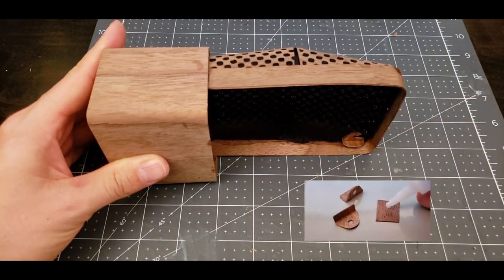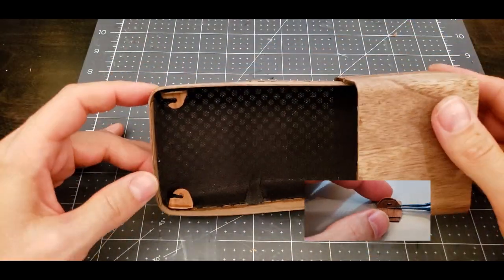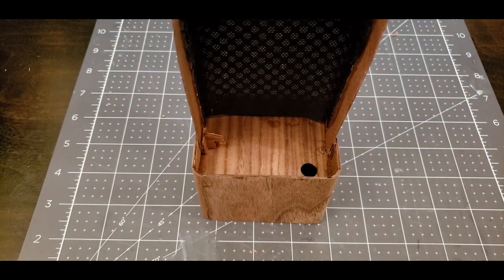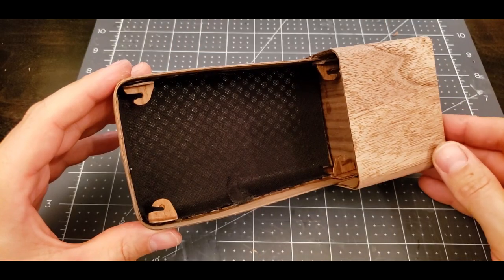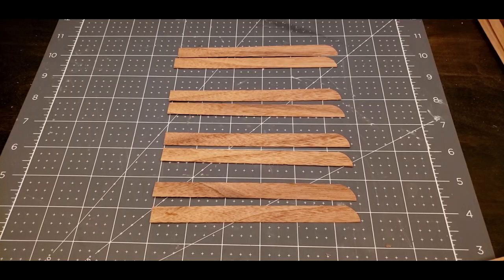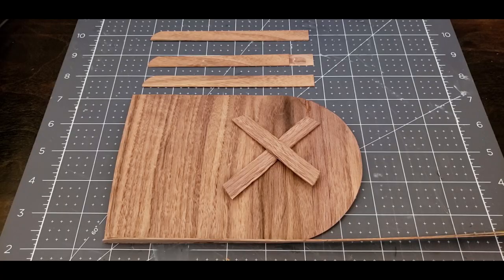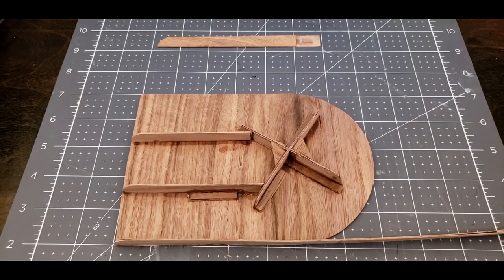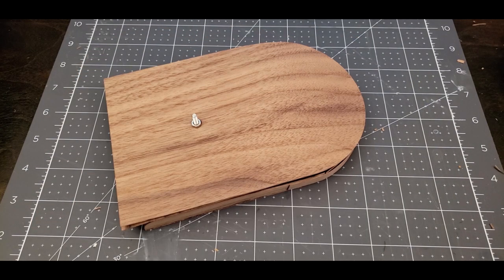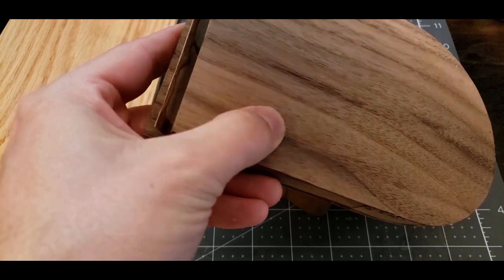Wood mounts are glued into the body of the microphone. The base of the microphone is made primarily of one-ply veneer. Most sections are glued together to make a stronger ply part. I used X-bracing to make the stand rigid. Since the big curve on the back of the stand is very wide, it doesn't require steam bending. The top sections, which will bend down over the front lip, will require steam bending as part of the final glue-up.